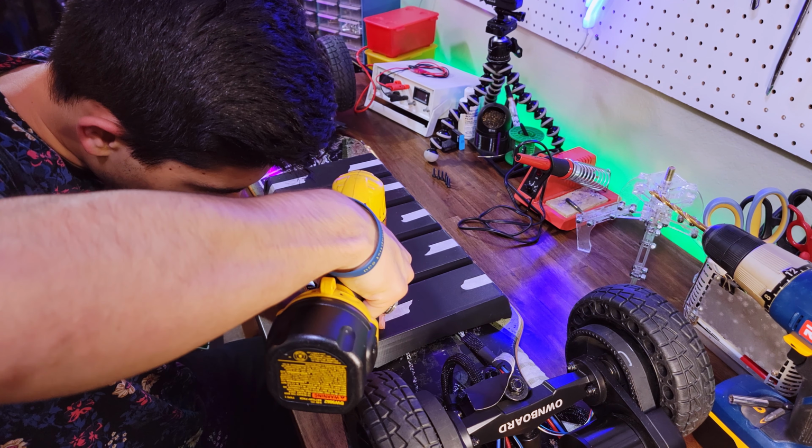Alright, so I've just started to drill out the holes, and I've got my 1/4 inch bit with the tape set to approximately the depth of an insert. I made it just a little bit shorter so that I can account for the tip, and once I screw in the first insert, then we'll know exactly how long to make it, and I can readjust where the tape goes. And I haven't started mixing it yet, but I've got my epoxy here as well, and I'm going to mix this up, and then we'll get to installing the first few inserts.